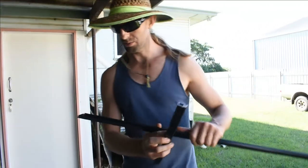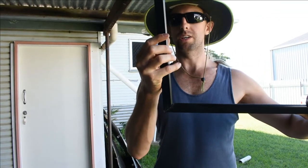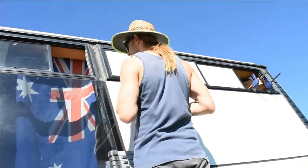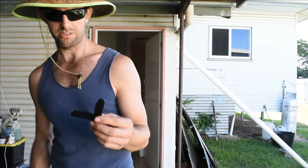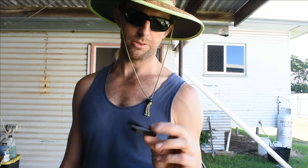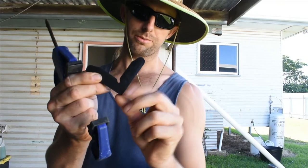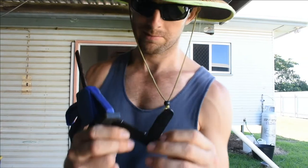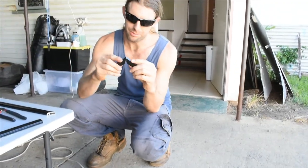This is what I mean when I say miter the corners — so that's going to come together like that. As I mentioned, these corners are only right-angle corners but the angles on the window aren't right angles, so I'm going to need to modify them. The way I'm going to do it is cut diagonally down and stop just before the corner — that should give me freedom of movement while still having a little bit of structural integrity to the frame. It's not the neatest job in the world, but it'll do.